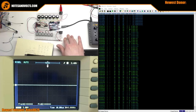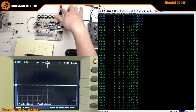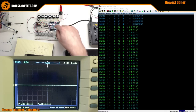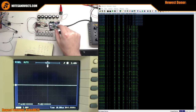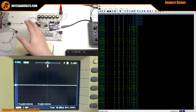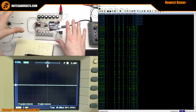Question from chat: can MIDI be routed through USB rather than a MIDI port? For this guy it's only 5-pin DIN MIDI. We're going to do USB MIDI in the future but we'll switch to the Teensy platform, which works as a USB device very simply - no pain involved. Why kill ourselves with the Arduino when the Teensy makes it easy? We're going to get something better.